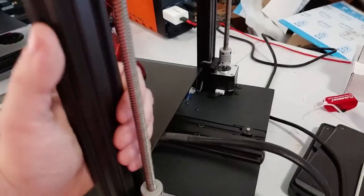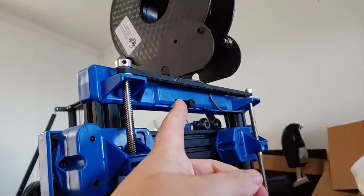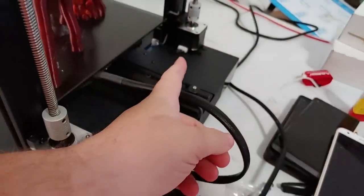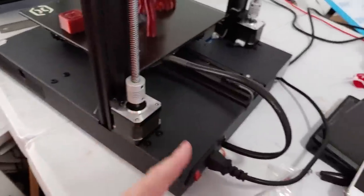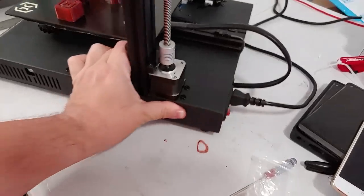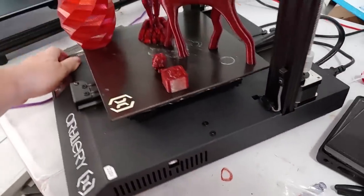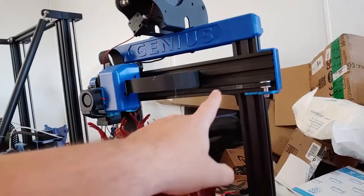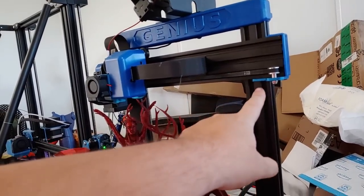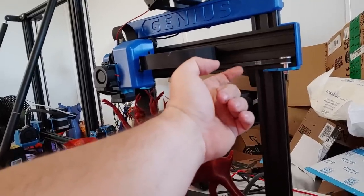After the four bolts and the one thumbscrew, you plug in two wires here, two wires there, your power wire, and you are done. It is one of the fastest, most error-free assemblies I've ever had with a 3D printer. The only adjustment I had to make out of the box was that the X belt was too loose — I loosened two bolts, pushed the tensioner out with my finger, and re-tightened it until there was a little thrumming.